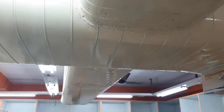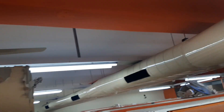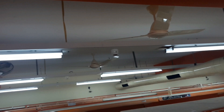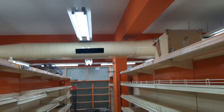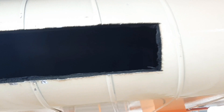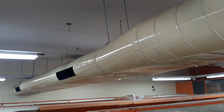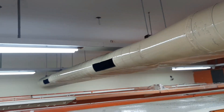These are the two branches and this is the main line going till the end. The grid openings are 18 inches by 4 inches. Inside, the duct is thermally insulated with nitrile rubber of 9 mm thickness. You can see the openings for the grids on both sides of the duct.